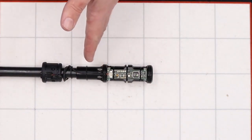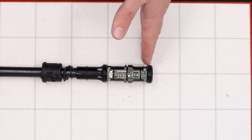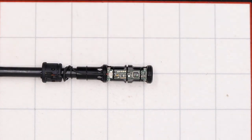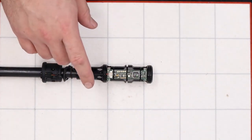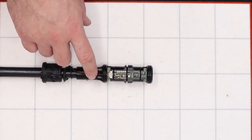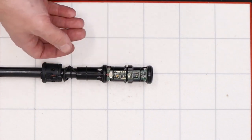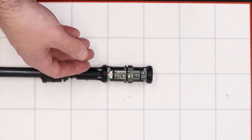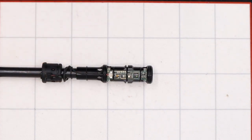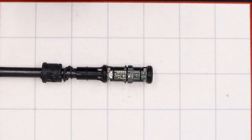I won't bother removing this one as it's a fairly simple job. However, I will mention there is an O-ring at the back of the tube and between the tube and the brass nut, so if you did take it out just be aware of those. Another thing worth mentioning is that this is one of the newer style chronographs with the aluminium housing on the end of the barrel. The older versions or sub-12 versions were Delrin, although they are now being upgraded to the aluminium ones.